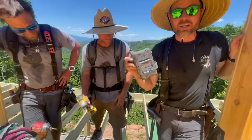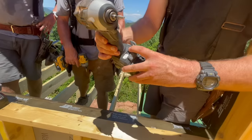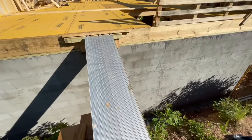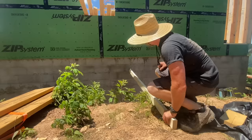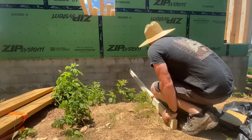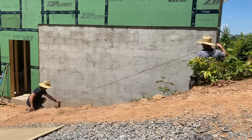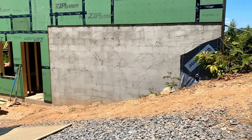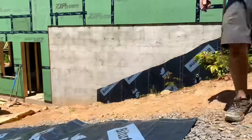With some time left in the day, we decided to go ahead and double top plate our walls, and also put the waterproofing membrane on our block wall. I'm using a board to level across from our top grade to see where we needed to run the waterproofing membrane up to. In the summertime, I generally don't run it past where it needs to go, because that means you'll have to pull it off later, and when this stuff is hot it's about impossible to get off the walls. After making a good educated guess about where the final grade would end up on this basement wall, we snap some lines and use those as a reference to run the top edge of our waterproofing membrane to. Pro tip: install it vertically — I've tried installing it horizontally once and I will never attempt that again. It goes on much easier this way.